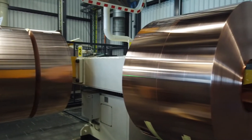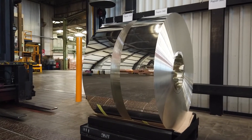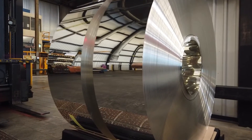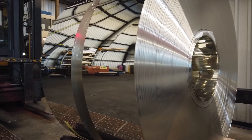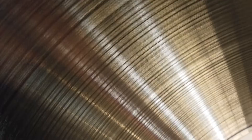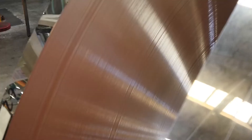The coating thickness is clearly specified. After the coating process, the material is in the form of white coils located on pallets. The strip surface and edges are covered with silvery shining tin. After being slit, the slitting edges are partially bare and have a copper color.